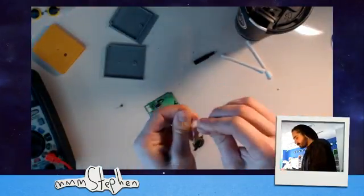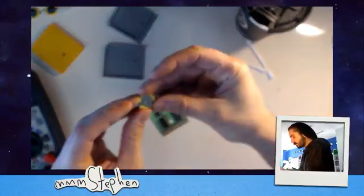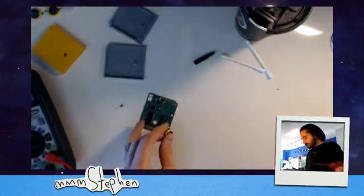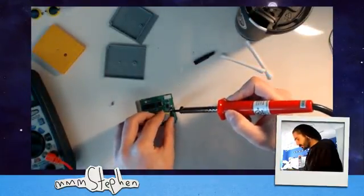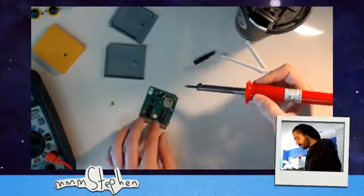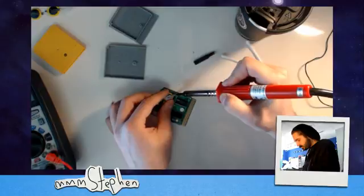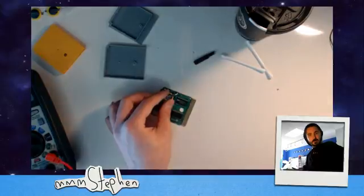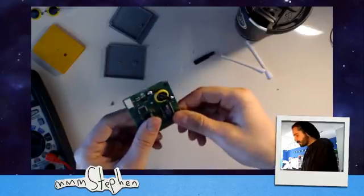So yeah, new batteries, dirt cheap from eBay. I'm going to keep repeating that. I buy all my junk from eBay. Positive is the printed side, and positive on the top. So to solder, again, you heat both things you're sticking together, and then apply solder. I'm doing it backwards here. There's a bunch of solder on it already, so I have to heat both areas and let the solder bleed over it long enough to stick. Perfect. And then do a little tap to make sure it's still in there. Ooh, that thing's still hot.